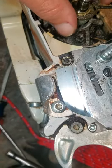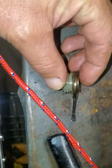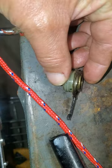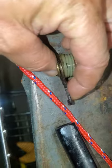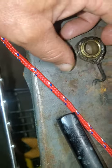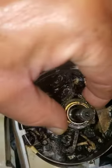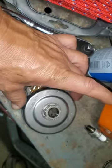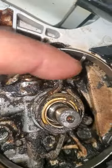So this thing wasn't able to spin — I'm guessing it had to be because of the bearing failure I showed you earlier — and it caused everything to start wobbling around. Your bar wasn't getting lubricated because of this not being able to spin. When you put this in and put on the clutch drum, there's a little tick mark — see that line right there — it lines up with that notch and is supposed to go down and grab that.